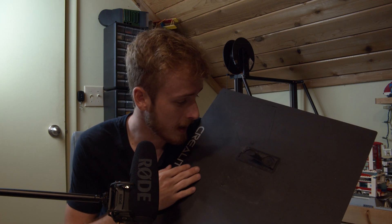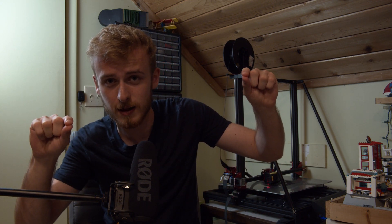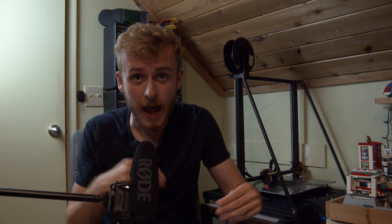This is the printing surface that comes with this printer. The way that the offset — these motors constantly warping and moving — what would happen is they would get slightly bent and then cause slight changes in the way that the printing surface worked. You'd have a slightly lower spot here, which is why you get layer compression all the way up. What would happen is it would level and then be slightly off, so it would either scrape the entire surface of the board, print way too close, or not even make contact at all. And then you'd end up with another failed print.